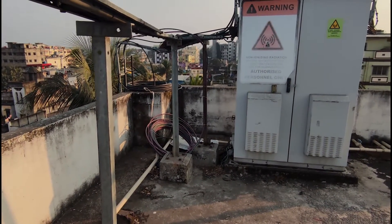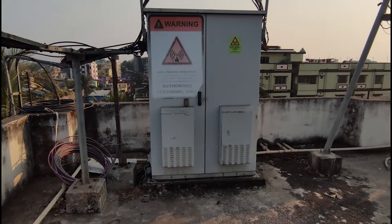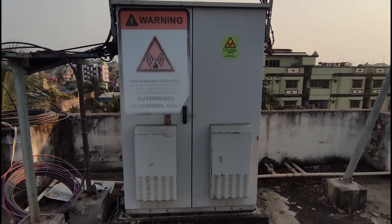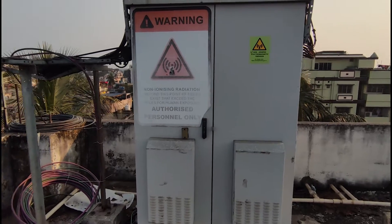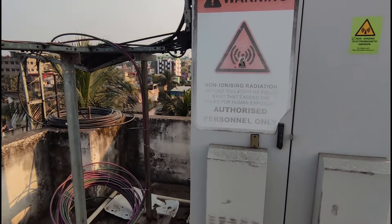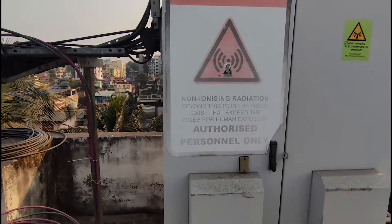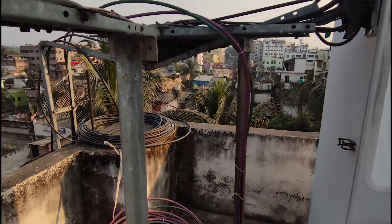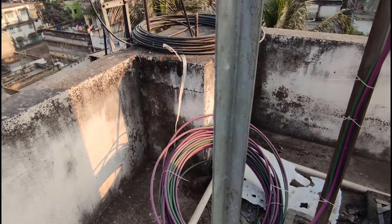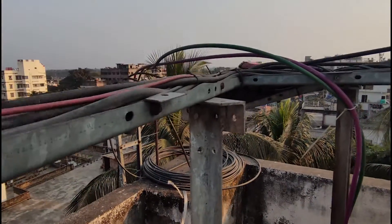This is the video about the cabinet which is basically shut and it is like a black box to me. The only thing that is certain to be inside there is the Samsung CDU or the baseband unit. It will process the RF feed coming from the radios. If this cabinet was not here, this site could possibly be a centralized RAN or a cloud RAN where the baseband processing was being done at a far edge data center.